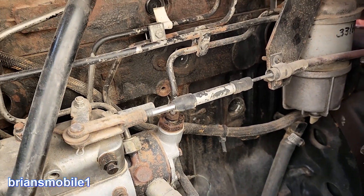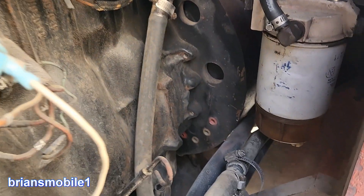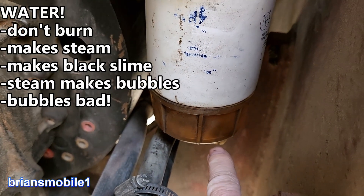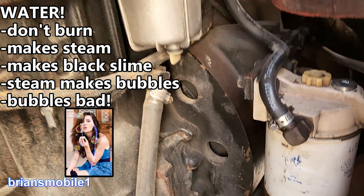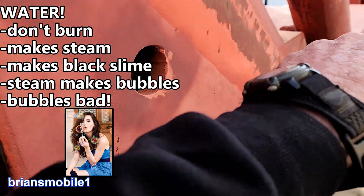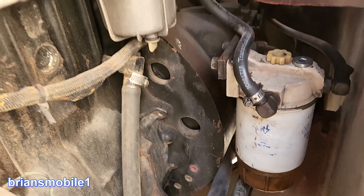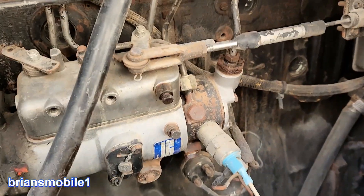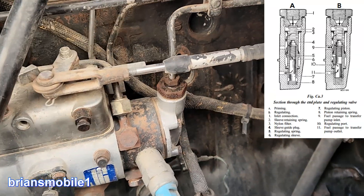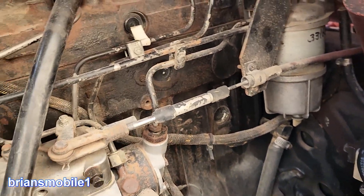When you need to get water out of the system, water comes out at the bottom of one of your filters — there's a little drain at the bottom there. Water is heavier than diesel fuel. You want to get rid of water any time rain gets into the fuel tank, because otherwise you get algae — dark green or black algae — that will plug up all of your tiny orifices in your injectors or filters. There's also a little filter underneath this plug. Once you change your filters and purge the air, that's how you do it.